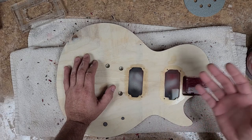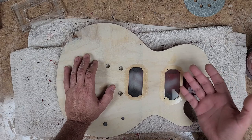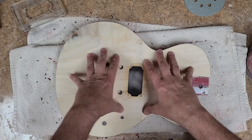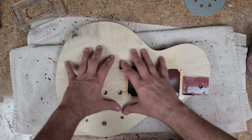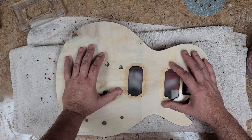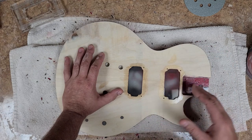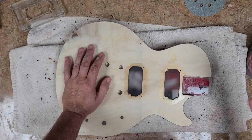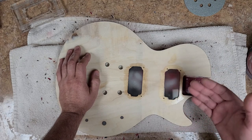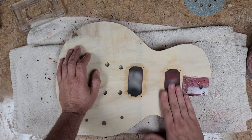The reason is: wood expands and contracts, but that epoxy resin is not going to expand and contract. It's more solid and doesn't have the pores that wood does. So what's going to happen is the wood will move but the epoxy resin will stay in one spot — you're going to get cracking around the area. Think of it like pouring concrete and using rebar to reinforce it. That's what I would have done if I was just going to cover this up with paint.